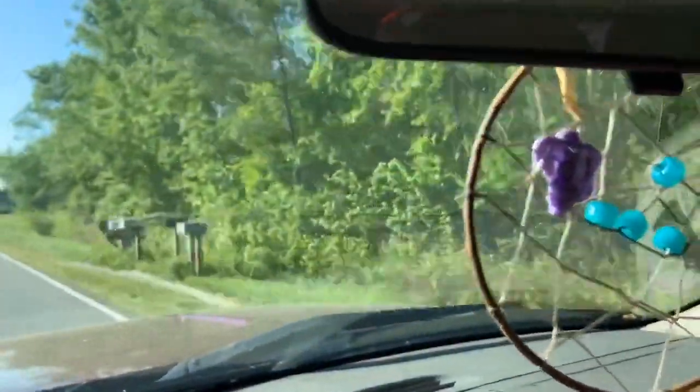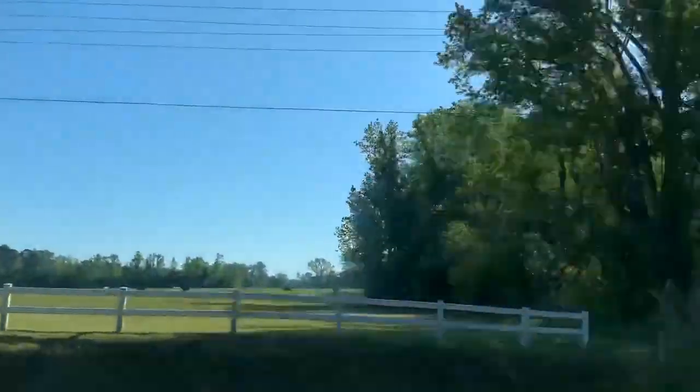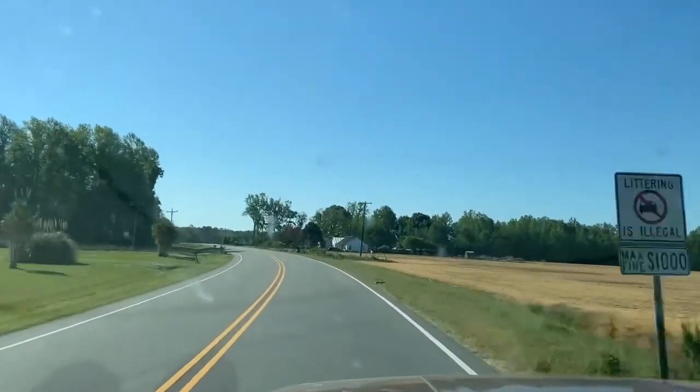I'm heading over to this house to check out a 15 SEER heat pump package unit that I put in. We're doing a combination of a maintenance visit and a service call. They said Terry — my brother — came out last year, looked at the unit, and said the high pressure switch was bad and needed to be replaced. I think it was tripping early. On these Goodman slash Amana package units, they can have wiring issues at the high pressure switch where you might hit it and it'd be loose. We can order a new pressure switch — it is under warranty. Maybe even do a pinch-off and re-braze.